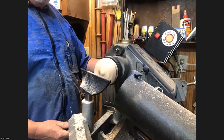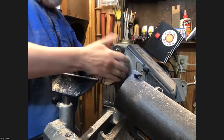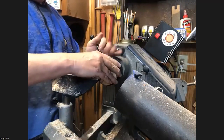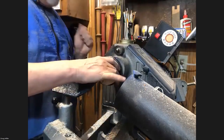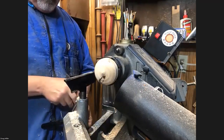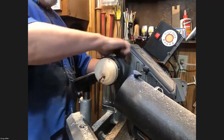It came loose again because I'm cutting it out and I'm pulling the wood right off the chuck. See how close we can get to that pop without getting there. All right. And two, the thinner I go on that edge, the more likely it is to pop. So I don't want to go too much thinner, even though I got a little bit of room. But I'm almost where I want to be anyway.